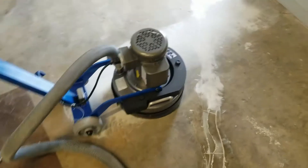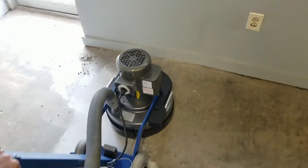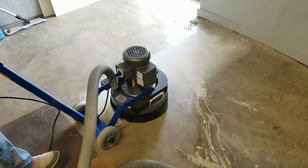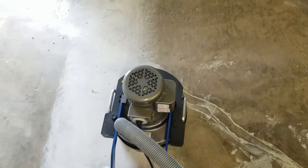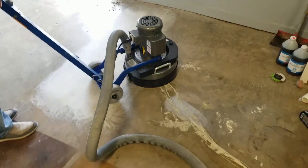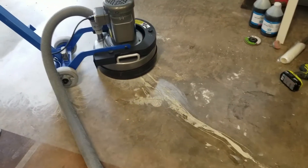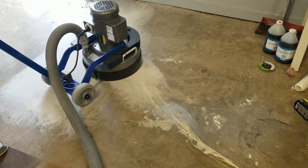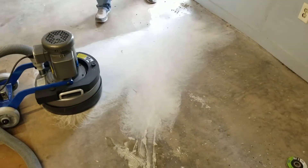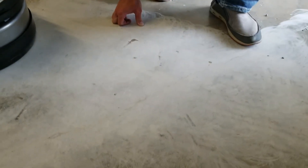You're kind of overlapping a little bit — overlapping the pass by a half to a third. We'll show you real quick what's happening here. We're grinding the floor. What you're really going for when you grind and prep a floor is what we call a complete whiteout.